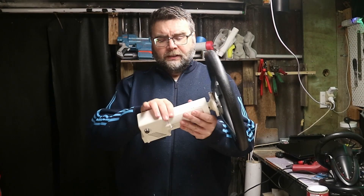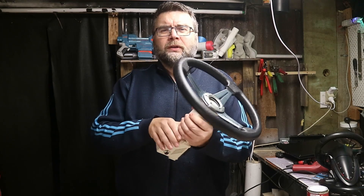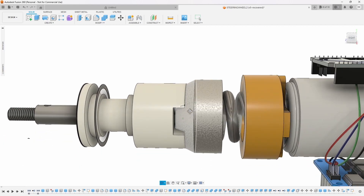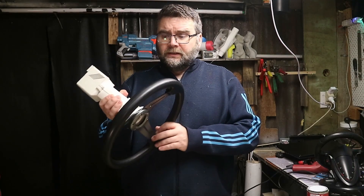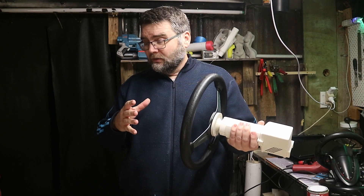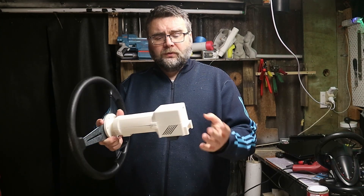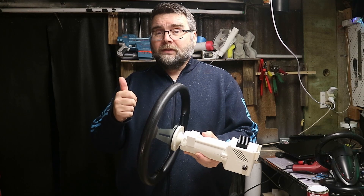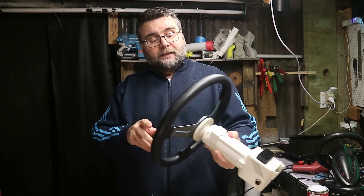The theory is good and it's going to work, it just needs some tuning. I need to pull the top off to see what's going on because it sounds like the coupling and motor are jumping teeth — there's probably too much torque. It's definitely going to work — it's well within the realms of this motor to turn this steering wheel. I can feel it fighting me when I'm driving, so I need to work out the software tuning. By the next video I'll also get the pedals going and a handbrake — it looks like this is going to work.